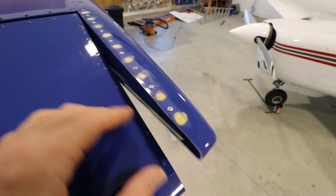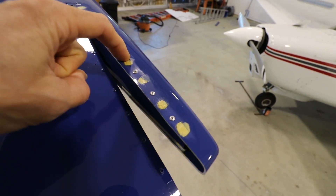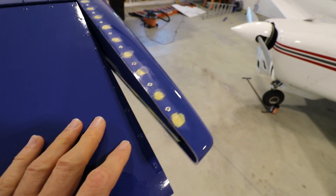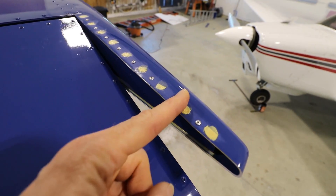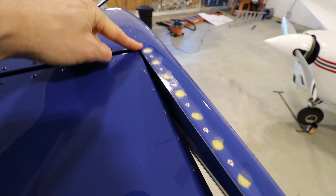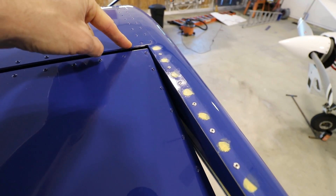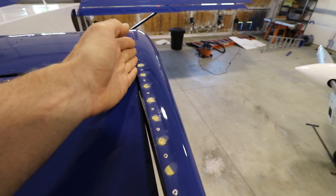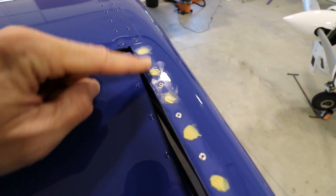On the previous video, I was hoping I could just drill out maybe three or four rivets, push the rib in, put in bigger rivets, and touch up a little blue paint on the rivet head. But that didn't work — even if you drill out three or four rivets, you really can't bend this aluminum rib and push the back half of it in. I had to drill out all of the rivets all the way up to what I call the pivot point — where this aluminum rib rivets to the aft spar of the horizontal stabilizer. When the plastic wingtip heats up, it pivots all the way up there, so I had to drill out all the rivets on the top and bottom all the way up to that point.